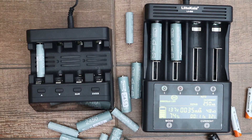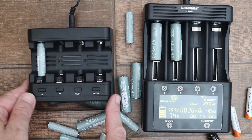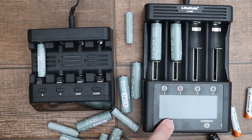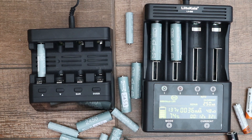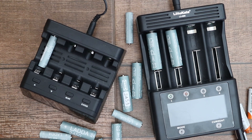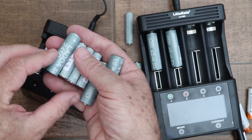The process I've been using to increase battery capacity takes a very long time. I've been using break-in mode with the PowerX charger because it works very well, but because of the inaccurate reading on the PowerX I then do a discharge and charge with the Litokala to get a more accurate reading. The repair process isn't always successful and sometimes the capacity actually decreases slightly; however, most of the time there's an increase and repeating the process again sometimes results in further increases.